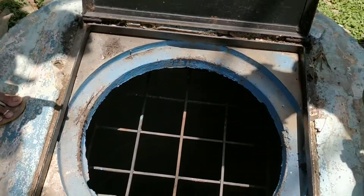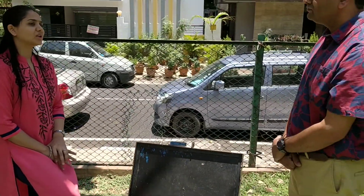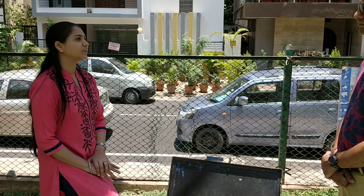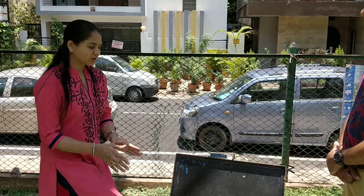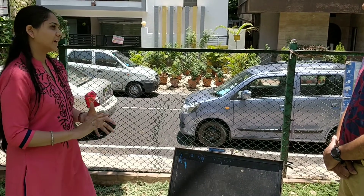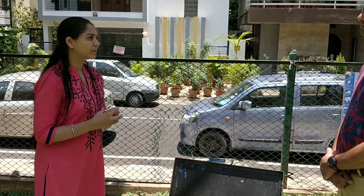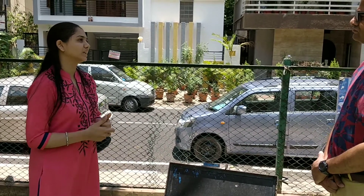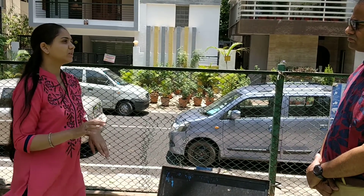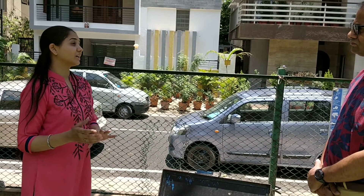You can see the pipe and how the inlet comes in. Some people have a habit of putting jelly stones inside the well — that is very wrong. With so many properties in Bangalore, the quantity of aggregate stones is not sufficient to fill inside. Also, if aggregates are put inside, after some years clogging will happen. Deposits will form and nobody is going to clean that. If we leave the surface open, we can scoop out the silt deposited on the first layer and put it into the garden, but we can't clean aggregates inside.